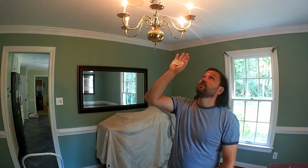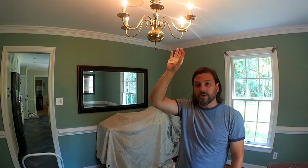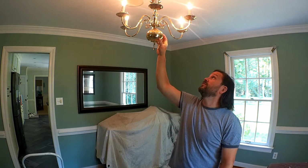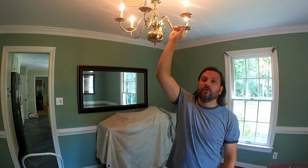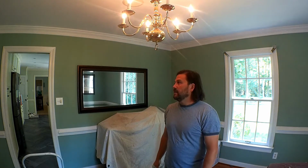The first thing that I'm going to do is just drill a small pilot hole before I take the hole saw to it and drill a bigger hole, and then we'll go ahead and fish a new wire to the light switch itself, because the problem is this existing wire will likely not be long enough to extend out and also wire the new light fixture that we've created.